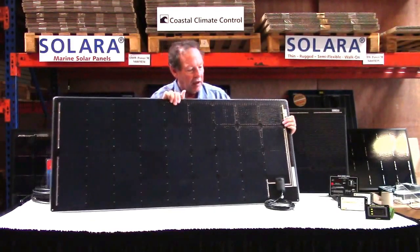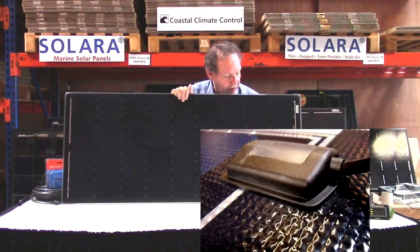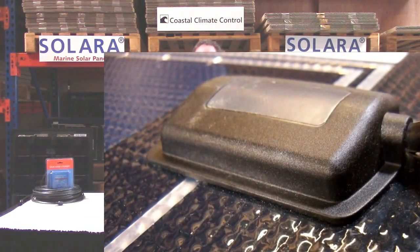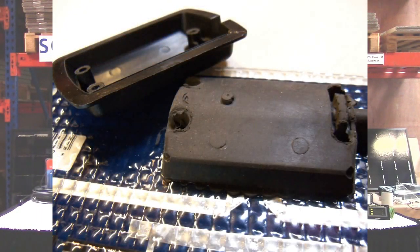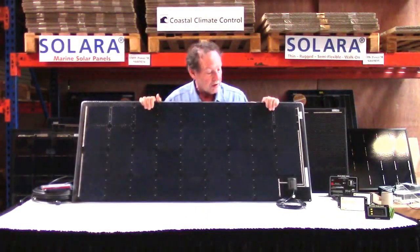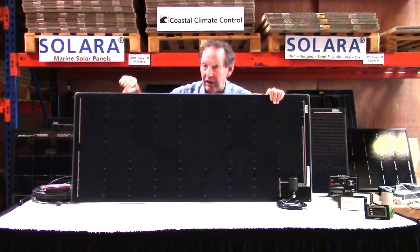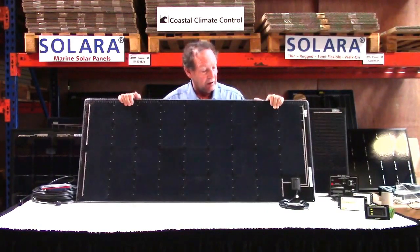The cable enters or exits from a junction box here — very low profile — but that is potted in rubber so even if you kick it or hit it with a wind channel or whatever, it would not leak water in. Some panels have the cable going directly into the edge into a laminated panel, which is somewhere where water can and does seep in.